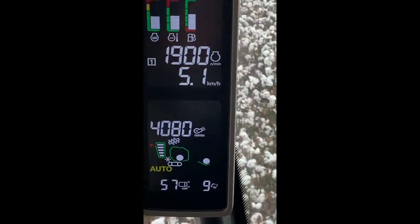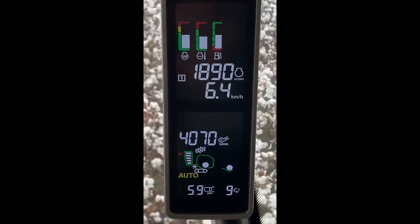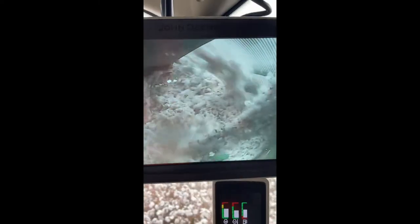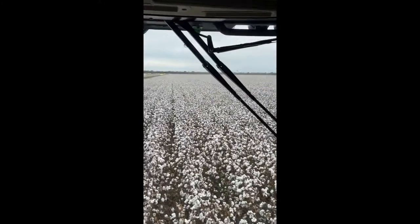Just keep it slow until the accumulator starts dropping, then back to operating speed. That's the cotton going into the accumulator. What's going on here in the camera is the right side — the far side of the accumulator — has got overfull and forced me to slow down so I don't spill it. But the left side, closest to the camera, has so much space in it you can still see the auger. So that's the uneven filling that I'm talking about.